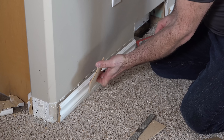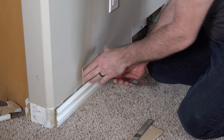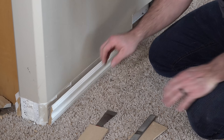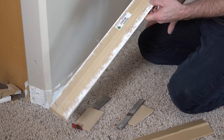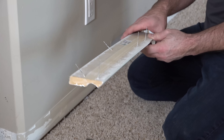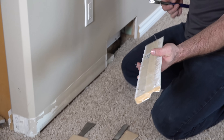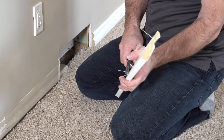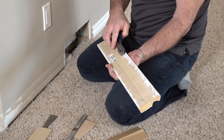I'll show you the little scuff mark you leave, but it's below the baseboard line. Once you get it loosened off a bit, you can use your scrap piece again and the other end of the bar, prying against the scrap so that your bar doesn't actually punch a hole through that drywall. Once you get it started you can usually pull it off by hand, and this is generally what you're left with. A lot of times most of the nails are going to pull off with the baseboard, so you're left with this porcupine of a piece of baseboard.